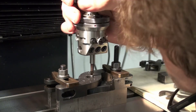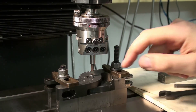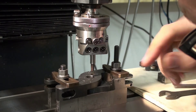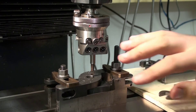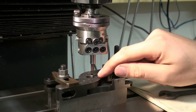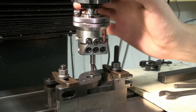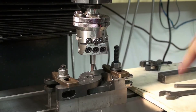We have the UP8-1 boring head set up and I took a first skim pass to see if this boring bar is long enough. It could be one millimeter longer, but it's barely long enough to reach through. So we can go ahead — let's take a one tenth of a millimeter cut.